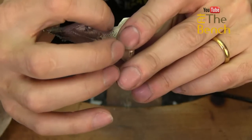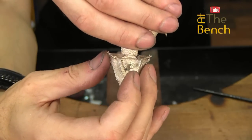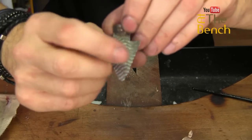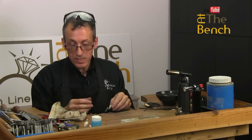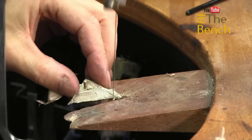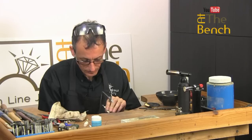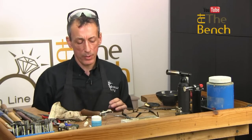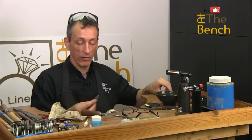I'm going to go over this with a brass brush, then cut across the top. That is going to be our arrowhead. Clean up all these little areas, trim off the excess bits, then put it in some Platinol or Liver of Sulphur just to give it that antique look. Then wipe it over with a rag just to remove the Liver of Sulphur off the high spots. Use a piercing saw to trim off the areas where silver has eased through the casting, a quick go with the brass brush and a bit of hot soapy water, and that is our cuttlefish casting of an arrowhead.